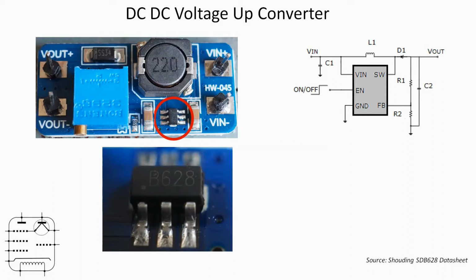You've pretty much got that circuit, with the only difference being that one of those resistors has been replaced by that multi-turn pot. I suspect it's R2. It's difficult to see on the circuit board because the traces are covered up by the components, but I strongly suspect that. So that's essentially the circuit, and there's lots of information in there.